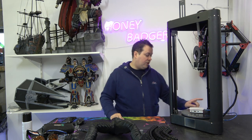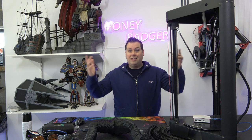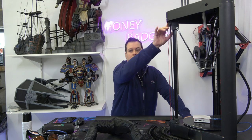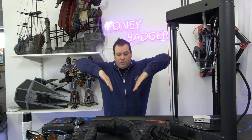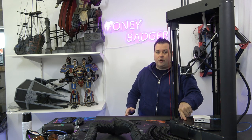There are some sacrifices. We've lost about 10 millimeters on the outside of the bed because of how we designed these brackets. We have a modified bottom and top shoe that allows us to slot in the 2020 extrusion, and then the linear rail goes on the front of that. As a result, the Delta arms are more vertical, which means they can't go past a certain point — and that point is not the outside of the bed. So we've unfortunately created a bit of a hardware restriction there.